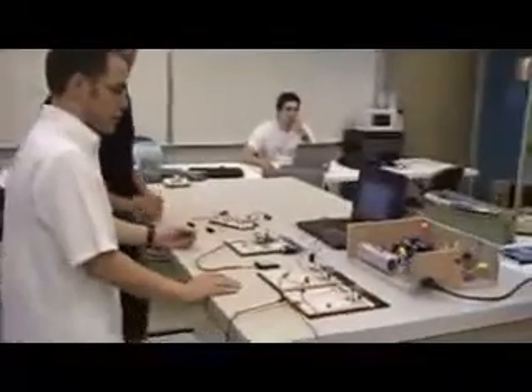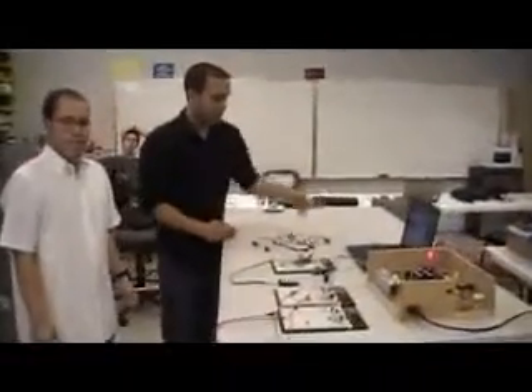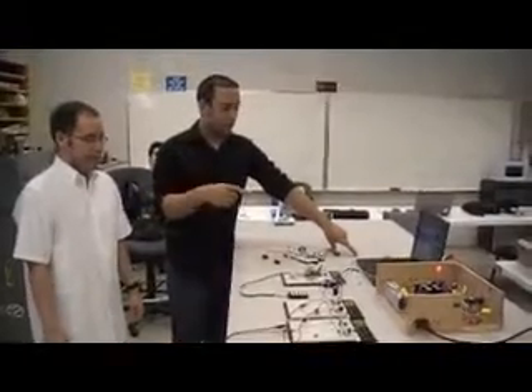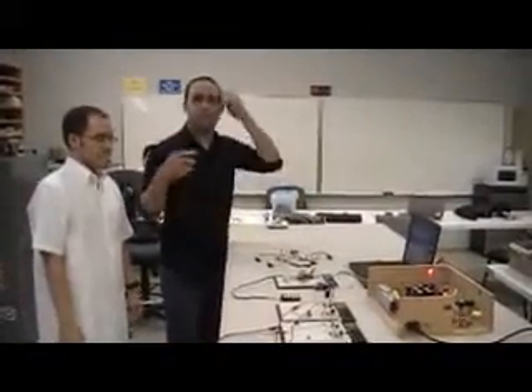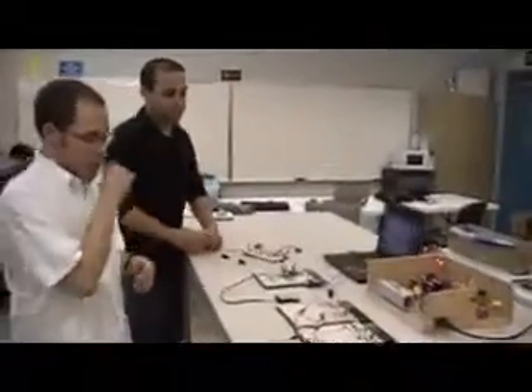The system is composed of a power supply, two magnetic sensors that have two inductors in the floor, a main controller, and infrared sensors for measuring distance. This tool will be used for knowing if there is any free space in the parking lot. It will count the cars that go into the parking lot and also count the cars that move out of the parking lot.